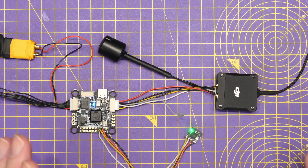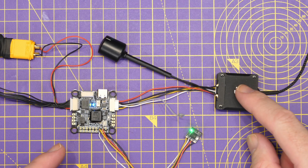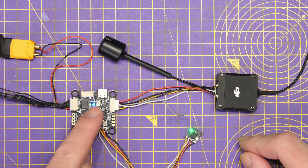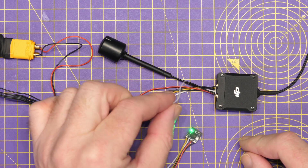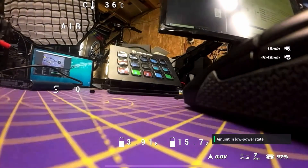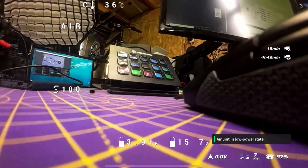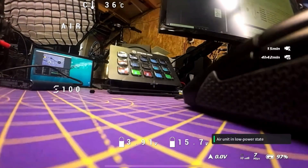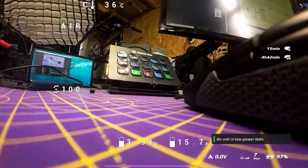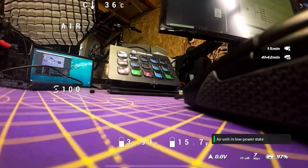The first scenario I'm going to show you is a loss of the grey wire, which is the TX from the O3 unit to the RX on your flight controller's UART. You can see that I've disconnected that wire here. If we look through the goggles themselves, you can actually see that in this scenario you do get OSD. If I move my throttle up and down you can see that it is reacting, and the battery voltage is correct on the Betaflight OSD and everything else is showing. What you're not getting though is the information on the DJI OSD.